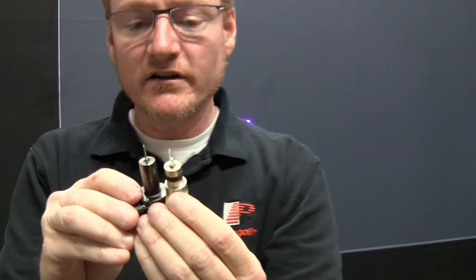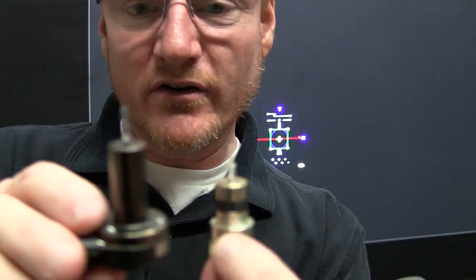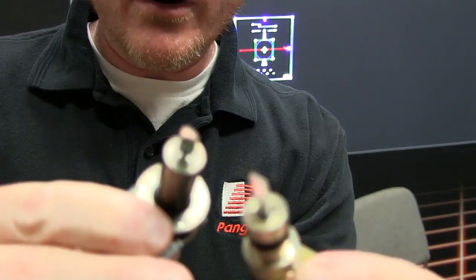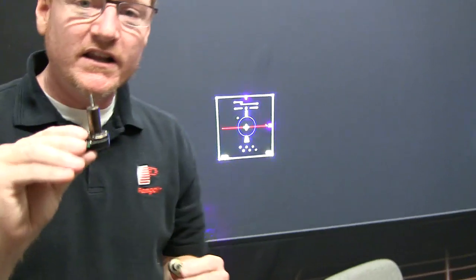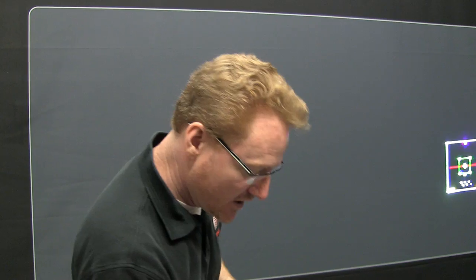Another thing to take a look at is the size of the shaft. We can very clearly see it is much bigger on our scanners and much smaller on the conventional scanner. And finally, the thickness of the mirror, which you can see is much bigger on ours, and perhaps see on the video just how small it is on these conventional scanners. Now, the conventional wisdom was that when you make the mirror small and thin, you make it light, but the problem is that when you make something so thin, it makes it really flimsy. And so that really winds up being a problem with a lot of these conventional scanners.